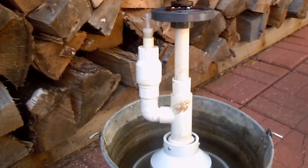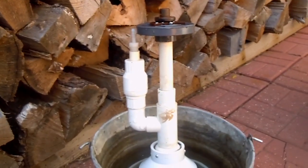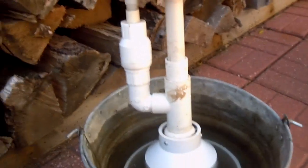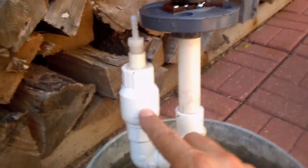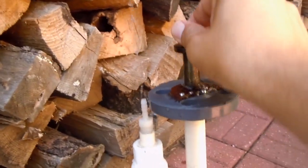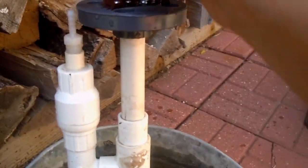What we've got here is the pump that will go at the bottom of my well underneath the windmill. The way it works is we have a check valve here that lets the water go out and up, but it won't let the water fall back down into this chamber. We have the piston and another check valve.